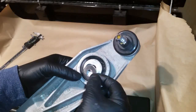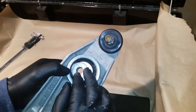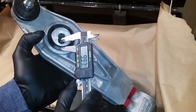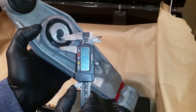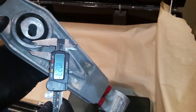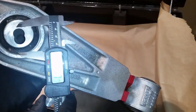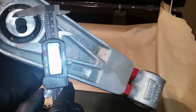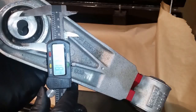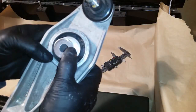This is just a washer to show you — when you use it on the outer hole, it should not contact this rim. As I said, the maximum from the inner hole is 9 or 10 millimeters. So with an inner diameter of 14mm and 10mm each side, that's 34mm — the outer diameter of your spacer should be 34mm. This particular washer is 31mm for example, and it comes up to there.